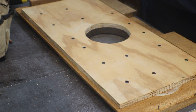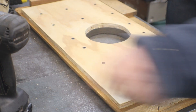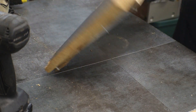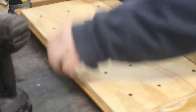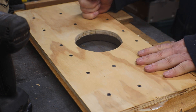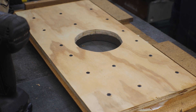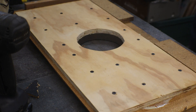Always know you're getting tight enough when you see glue starting to ooze out and squish. There. Makes it a little heavier, but we know it'll give us a lot of support for that upper piece and support the top of the cabinet a lot better. Plywood won't bust like this sawdust board - I call it sawdust board, some sort of particle crap. Now we've got to let that set up for a little bit before we can start putting it on.